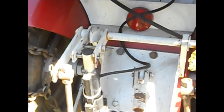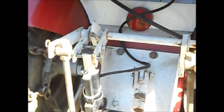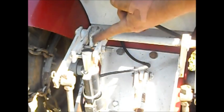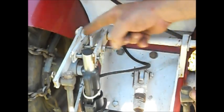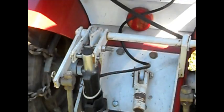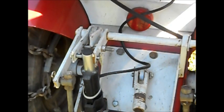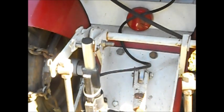As you can see, it floats — I just have a bolt going through it. There are two arms that come out and go through a pin to the top of the actuator. This part here allows it to float. If you want it to be solid, drill a hole through this piece right here, put that bolt through that piece as well as these two, and it will be solid — it will have downward pressure. This DC actuator will lift up to 1,350 pounds, so it's pretty stout and heavy duty.